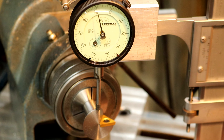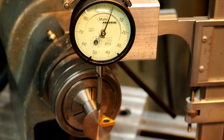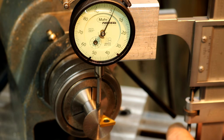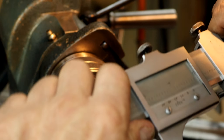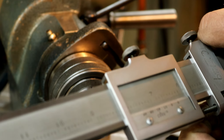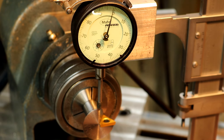We'll go over here to the top of the cutter and find the highest point. The tip on this is not flat — it's just a very slight radius on this tip, so it makes it pretty easy to find the high point. It only takes a few seconds. My plan is to set this at 6.300 before I even measure, that way I always have a starting point. That makes it a little easier to do — at least for the big ones, that's going to be the number.